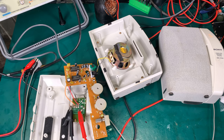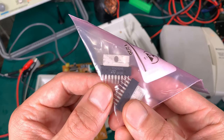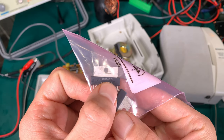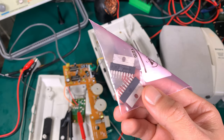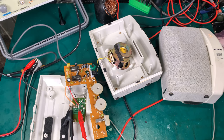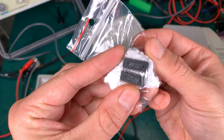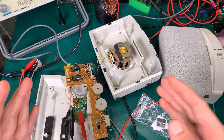The TDA was sinking to ground, and there was a second problem with the same channel — the socket wasn't connecting. That was absolutely amazing. So I ordered the TDA, and what arrived was a TDA 2824S — the 'S' in that naming stands for single inline package, SIP. I was unable to fit it, so I had to wait to get a proper TDA 2824 DIP. Today we are going to make a test.